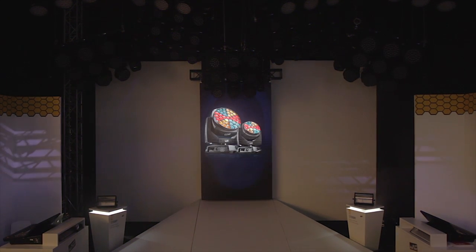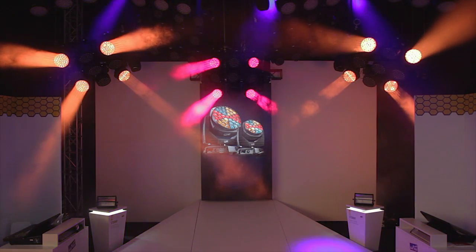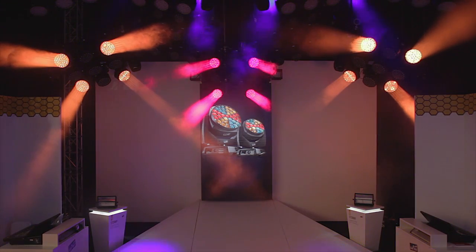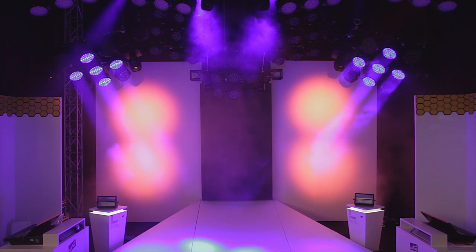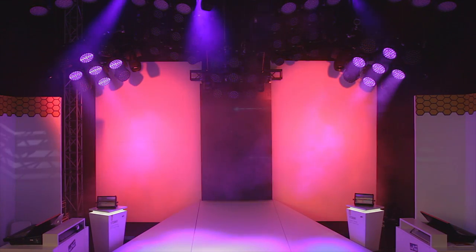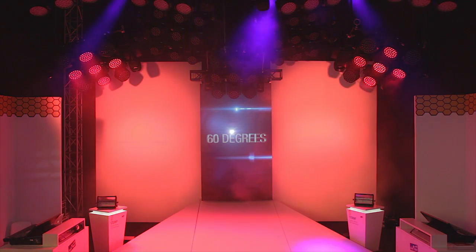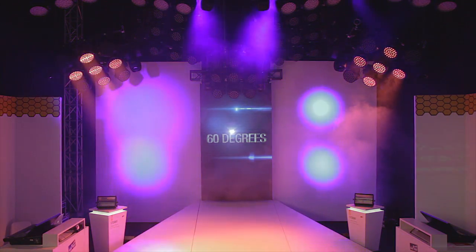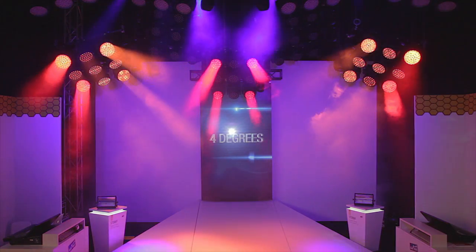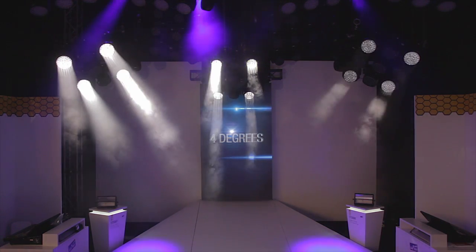B-EYE lights come in two versions, the K10 and the K20, and have many functions and different operating modes. First of all, B-EYEs are perfect LED wash lights equipped with an extraordinary optical unit. The beam angle reaches a maximum of 60 degrees, very useful when projection distances are short, like in theatres or television studios. The minimum beam angle is even more impressive, just 4 degrees. This means you can work well in large open spaces, like arenas.